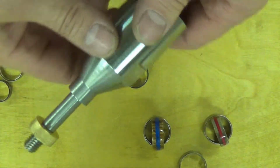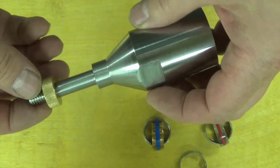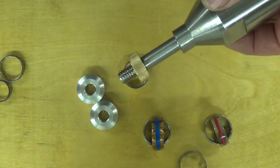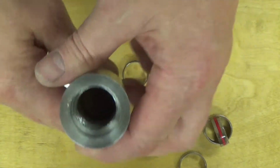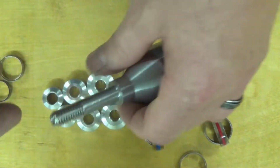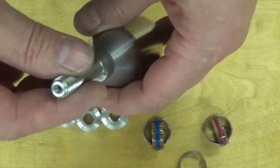I'm also anxious to try this ring mandrel that I got from the same place the ring cores come from. The link is in the description down there. It comes with 3 sets of bushings, large, medium, and small. And it threads right onto your lathe instead of an MT taper. It also has a taper on the end for your live center. Probably going to be pretty stable as it is, and probably won't need the tailstock.